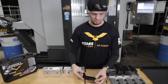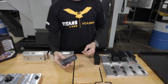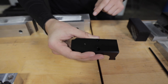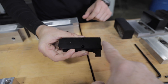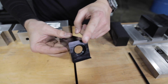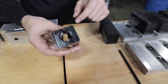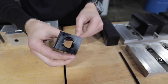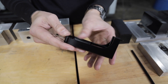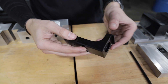This is a simple looking part, but because of the tolerances and how much material is getting pulled off of it, one of the important things is that this part has a very critical flatness callout right across that top surface — two thousandths, not crazy, but tight. Then you also have a perpendicularity callout to this face from datum A, and you have a true position callout on the location of this hole. All of these things combined with the material, how much is being cut off, where the tolerances are and how they work with each other actually does make it a tricky part.